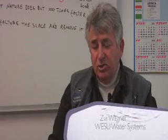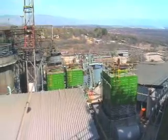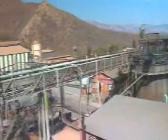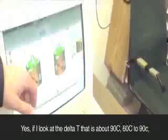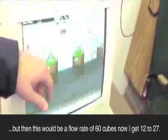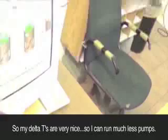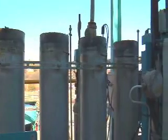The mine went from a situation of under-cooling capacity during hot water season to a situation where they now have over-capacity, and have to reduce the amount of cooling water supplied into the tanks by about 85%. Looking at the delta T's, this used to be about 9.6, 9, and the flow rate was about 60 cubic meters. Now I get 12 degrees delta T with 27 cubic meters. So my delta T's are very nice, and I can run much fewer pumps.